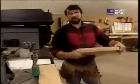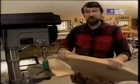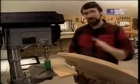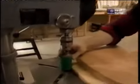Now, even with a really good bandsaw blade, you still end up with imperfections after cutting these curves. They're a little bit rough. And especially with this rocking horse, I want the bottom of this surface to be nice and even, because if it has bumps, it's going to jump around as it rocks. And to smooth all that out, I'm going to use what's called a drum sander.